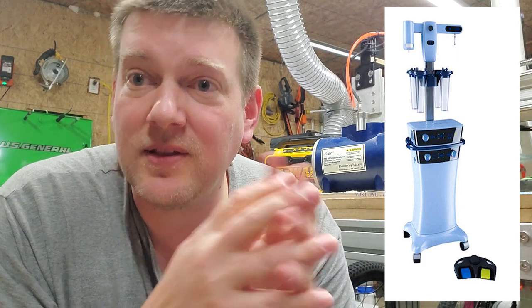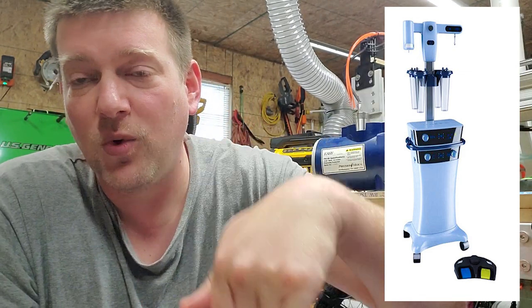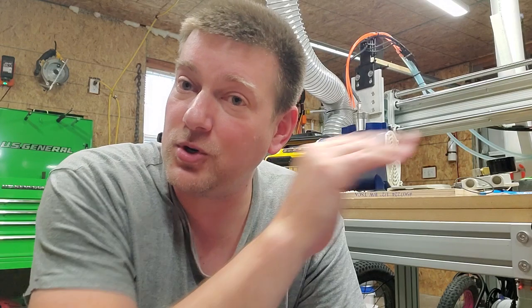My liposuction unit that led to the making of this video did not have helper springs — it relied on centrifugal force to throw those vanes out and wipe the edges of the chamber. Sometimes it would work; sometimes it wouldn't. If you get intermittent vacuum like that, you can hear the tone difference of the motor as it's spinning, because when the vanes protrude and wipe the edges of the chamber, it creates a load on the motor and you can hear it bog down. Some biomedics will want to replace the whole motor — one vendor suggested we change out the vacuum motor at an incredible price tag. But no — you can pull the heads apart on all of these pumps and clean them. They are designed to be pulled apart and cleaned.